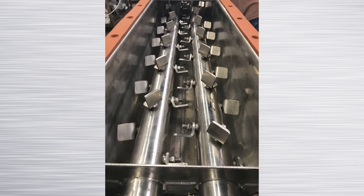The size of the mixer is designated by the diameter and length of the agitators. As an example, the mixer you see is a size 6 by 60, that uses agitators that are 6 inch diameter and 60 inches long.